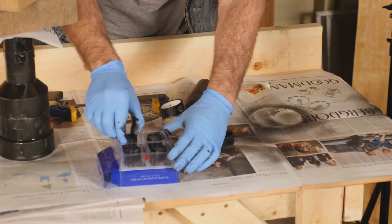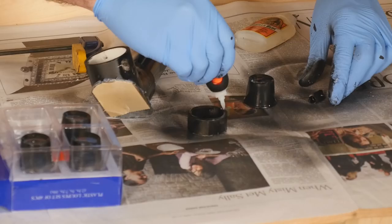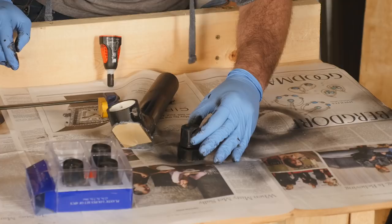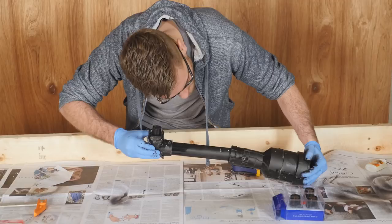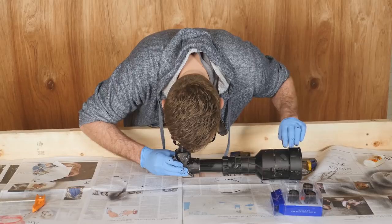Now to finish the eyepiece — grab the lenses you're using and mount them to the end of the right-angle adapter. The best eyepiece lenses I was able to find were actually jewelry loupes. I also used a small section of PVC pipe to help hold the lens in place. Finally, insert the extension tube with the eyepiece into the telescope body and test the focal length. You may need to cut off some additional inches of the extension tube to get the focal length just right.